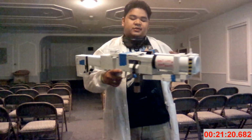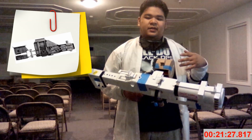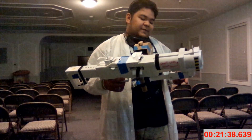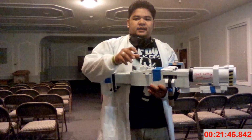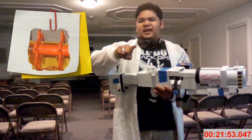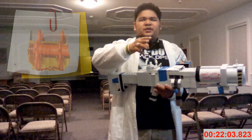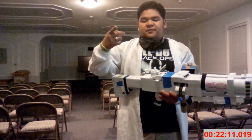And also the main idea here was whether I could apply a real-world mechanical feeding mechanism of an actual LMG, as seen in the PKP, Pecheneg, M60, Browning, all the belt-fed weapons in the world. Because most of the ones I've seen, if not all, I'm not going to claim anything, use a different system where there's a spoke with gaps cut in between, and you put the belt in those gaps, and as you fire, it rotates the disc, advancing the belt into the next groove, and that simulates feeding, rinse and repeat until you're out of bullets.